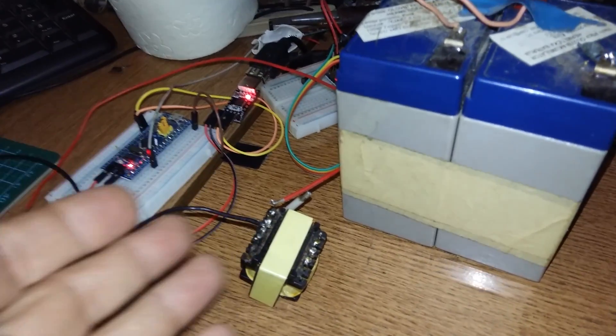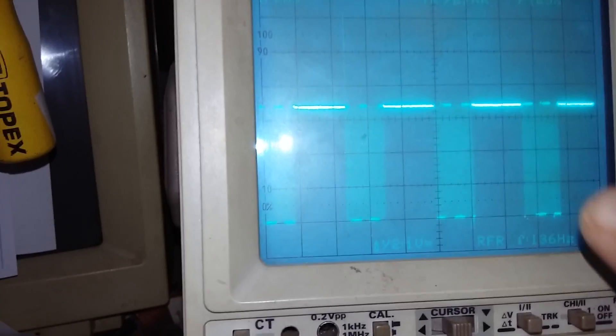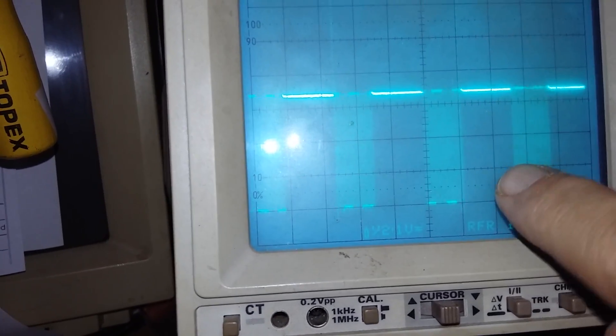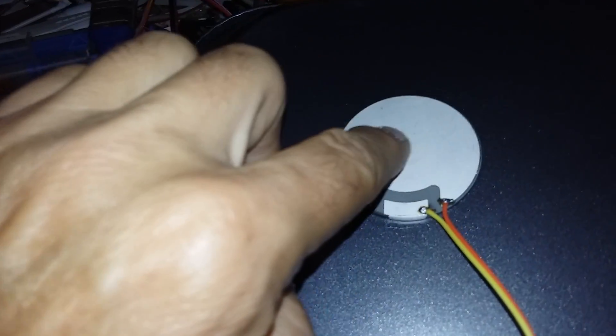Earlier it worked for a longer time and I made a modulated sound. It is pulsed at 40 kHz for some time, with nothing in between. When you hear the buzzing due to modulation, you know how it works. When you touch and pull your finger near it, you feel this buzzing noise. It is audible because of a parametric non-linear effect in air near my finger.